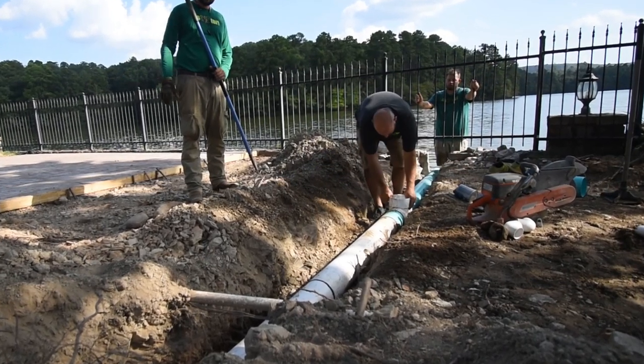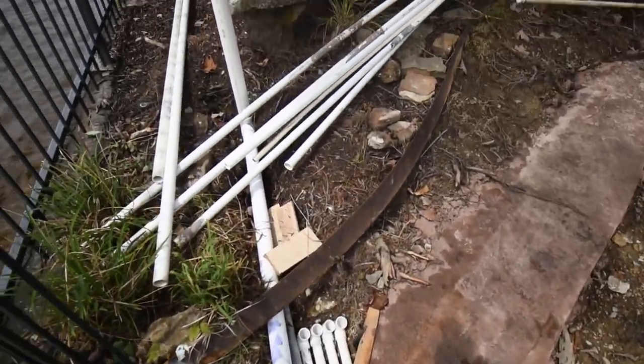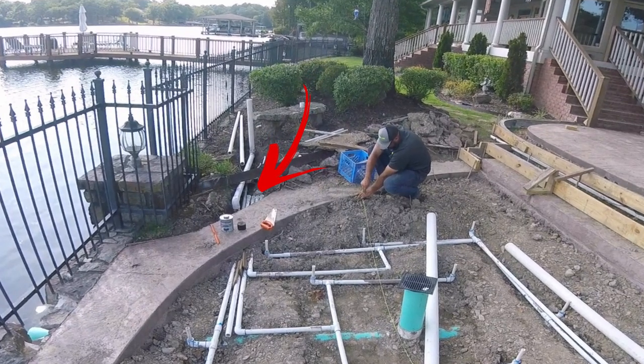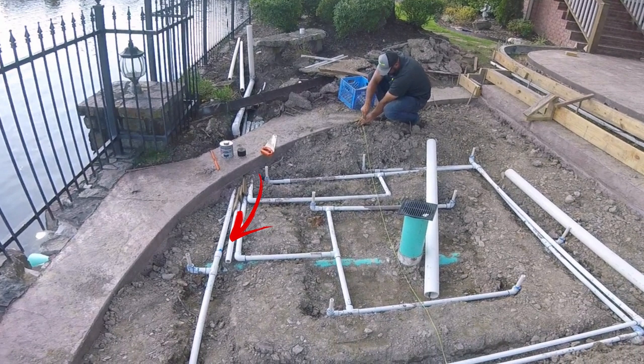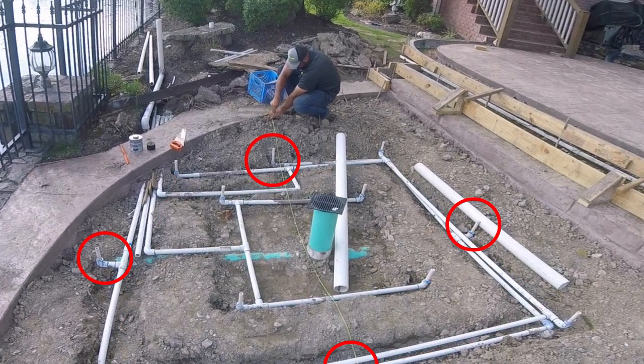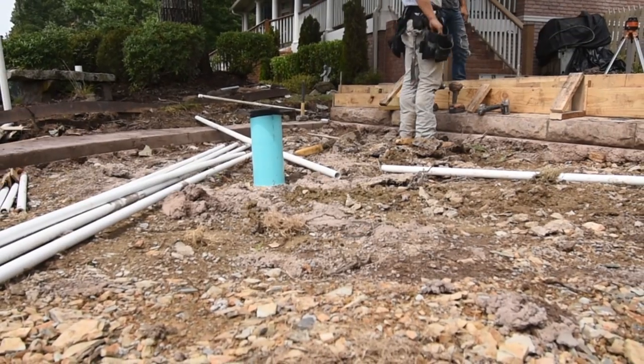The six-inch drain installed a few weeks ago is going to be the center of our splash pad area. When laying out this splash pad, we broke it into three zones. There are four one-inch schedule 40 PVCs that run through our border into the splash pad area — one is a sleeve for our lighting wire, and the others feed zones one, two, and three. Zone one is spaced two and a half feet nozzle to nozzle just outside the drain; zone two heads are spaced five and a half feet out; and for zone three we split the difference between the zone two nozzles to give it a circular look once finished.